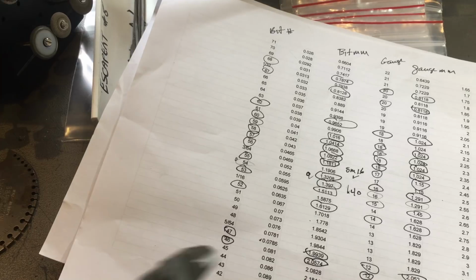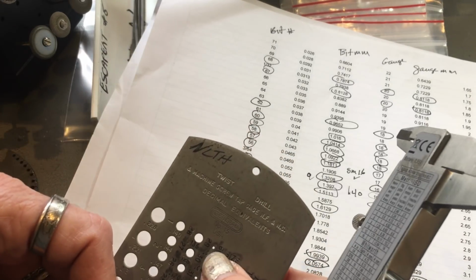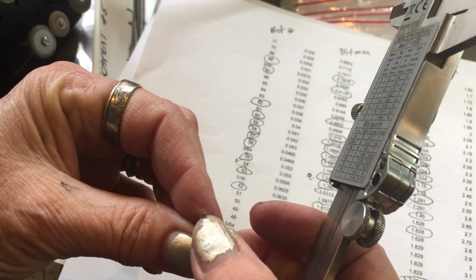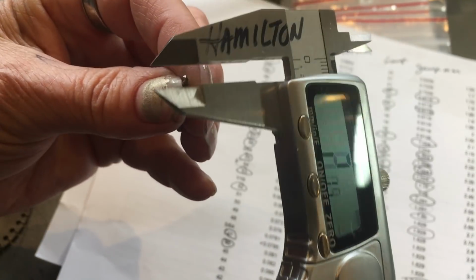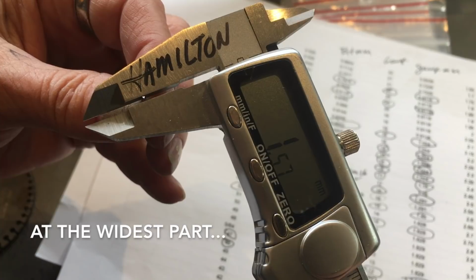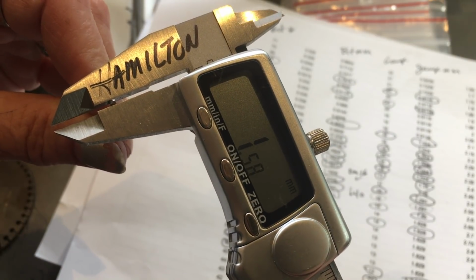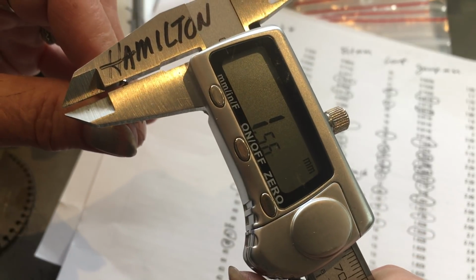If you do not have sufficient gauges, like if you had a drill bit that was smaller than a 60, somewhere between 61 and 80, you can use your calipers to measure. Remember, the diameter is measured margin to margin, which are the widest parts. So I'm going to put the tip into my calipers and observe the numbers on it. And then I'm going to turn it to the left and the right, and see if it goes any higher, all the while trying to keep even pressure on the dial.